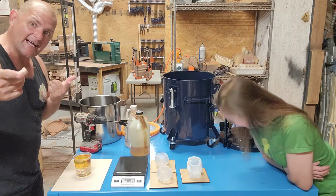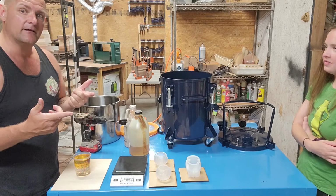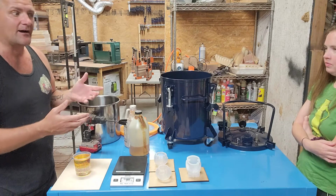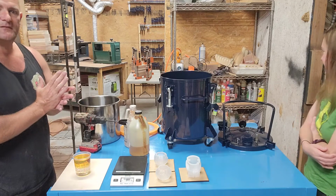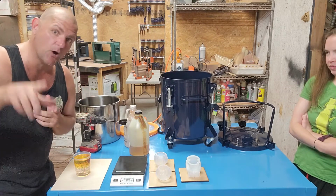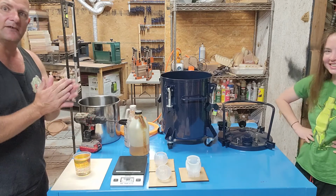Now, for you guys at home, what do we do when we spill epoxy resin on something we don't want resin on? And it's already mixed. If it's not mixed, it's not that hard to clean up. I'll tell you what we do. We use alcohol and we scrub it up before it has time to harden. That's the best thing that you can do. And denatured alcohol, which I'll definitely link below because you will definitely make a mess. Normally, you would wear gloves and protective stuff.